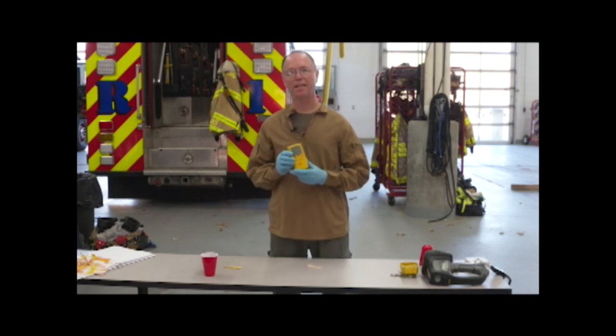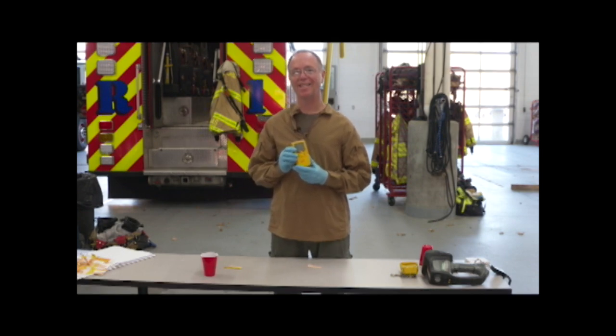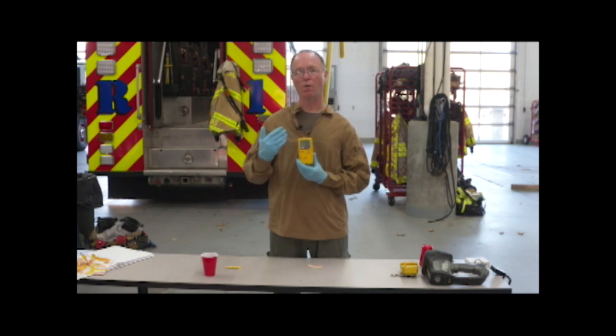Next we're going to talk about the four gas meter. The four gases detected are combustible gases on the LEL sensor, oxygen on the oxygen sensor, hydrogen sulfide, and carbon monoxide. When doing a hazmat investigation for rescue purposes, I am not concerned about carbon monoxide or hydrogen sulfide because while wearing turnout gear with an air pack, I am not going to be affected by those vapors. I am however concerned about being in a flammable atmosphere. If operating inside a building and your four gas meter LEL reading is increasing, once you hit 10% of the lower explosive limit, you should withdraw — because between your position and the gas source, you could be in the flammable range, and combustible gases igniting inside a structure can do so explosively.